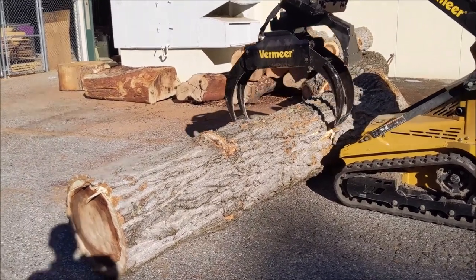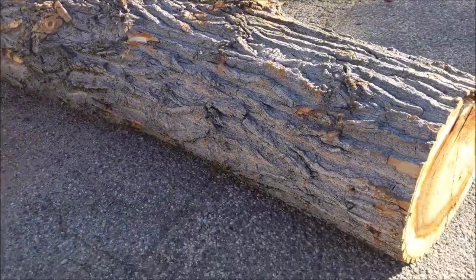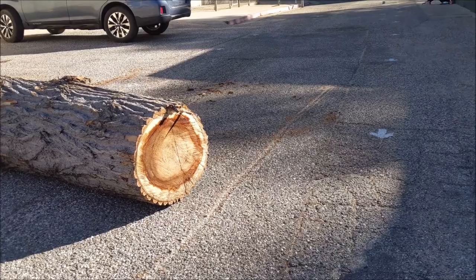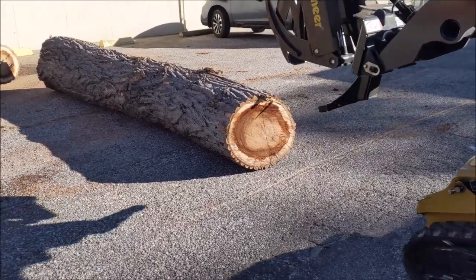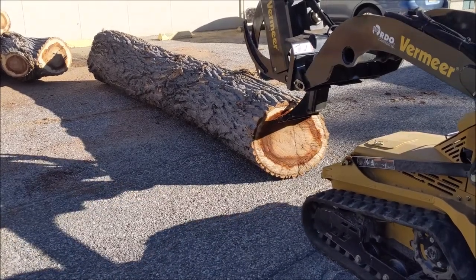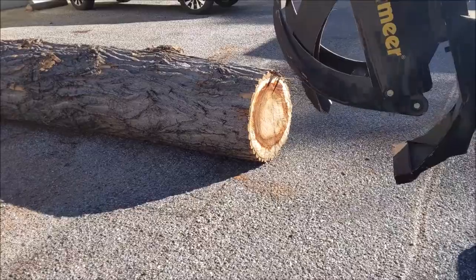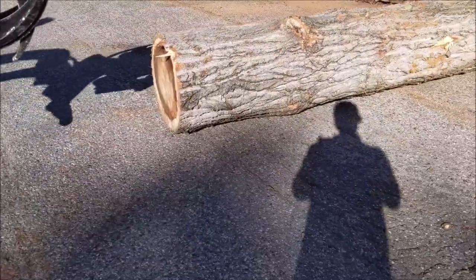This channel is All Things Wood and I love every aspect — the science behind the way trees grow, climbing trees, cutting trees, milling lumber, building wood projects. Basically with poplar wood, it's kind of split into two main groups: a cottonwood group and an aspen group. This is actually a cottonwood, and part of the ways you can tell is that when you mill and cut it, it's really soaked with water and it smells kind of strong in a bad way. All poplars — whether black poplar, black cottonwood, or aspens — have similar properties: really small pores so they finish nicely, machine really well in the shop, easy to cut, easy to plane, really lightweight, and just nice woods to work with.